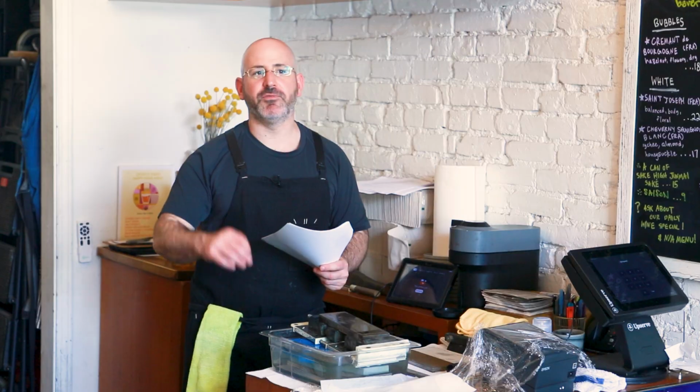There's nothing that matters more. You have the shittiest steel, the worst fit and finish. Everything else can be messed up, but if your knife is super thin, it's going to cut really well, right? Might not stay sharp for a long time, but it's going to cut really well. So in order to regain control over that, we do this thing called thinning behind the edge.